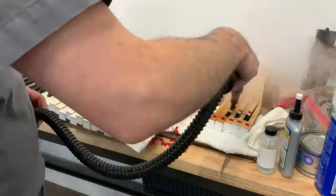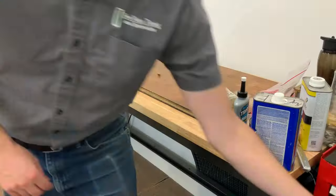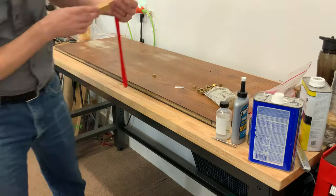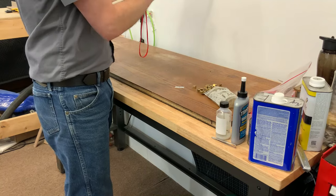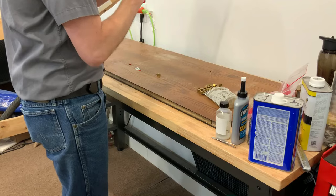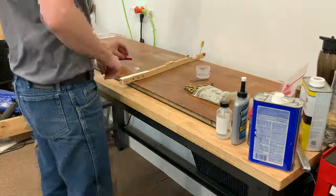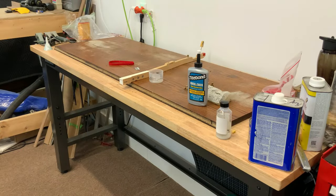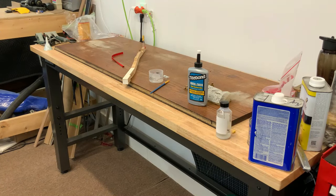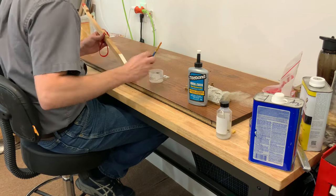Steam those out. So the front rail bushings, technically, they're supposed to be between 2 and 5 thousandths of an inch wider than the pin itself. So you don't want too much friction, but you don't want it too loose either. Here I've got a couple different sizes of felt, or it's cloth. You don't want it too thick, you don't want it too thin.